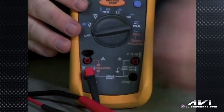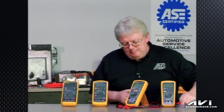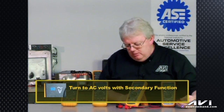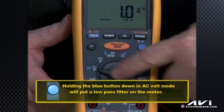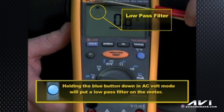If we unplug these leads and get back to the basic side of this meter, it works like any other meter. If we take the rotary knob and turn it to volts AC — that little sine wave symbol — we see it has a secondary function. Like all the other meters, we have a shift key, or alternate key — in this case it's a blue button. If you hold the blue button down while you're in AC volts measuring some AC voltage, a symbol comes up for the low pass filter, which filters anything over 800 hertz so you can see a clean reading with your AC multimeter.